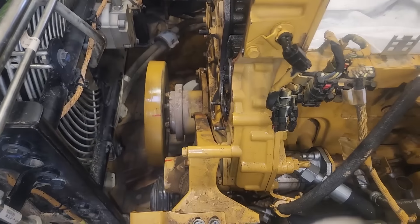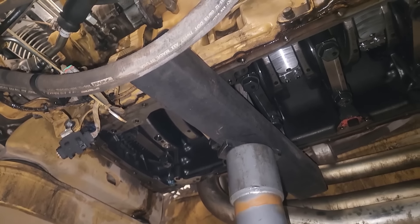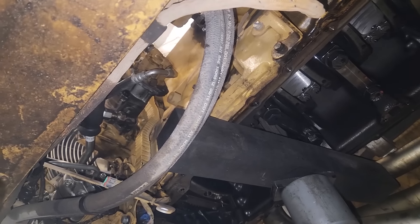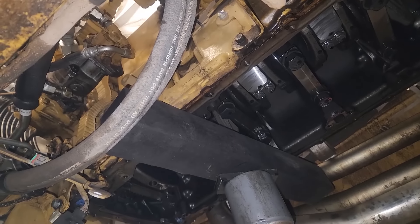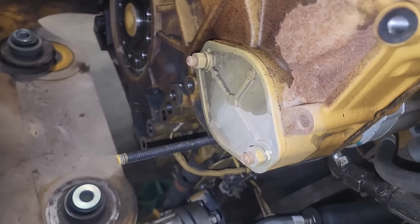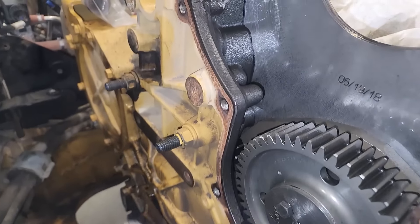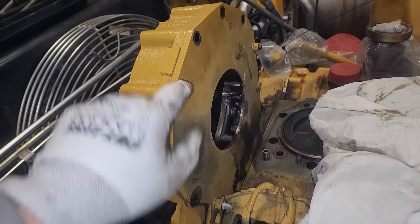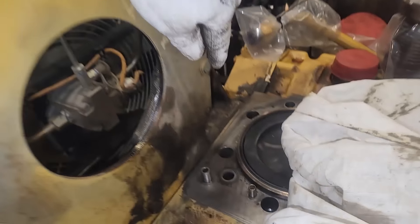Those are off - going to use the crane and get it out of there. So I pulled the oil pan, obviously. And what we're using here is this composite 4x4 and these pretty cool air jacks - you can run a pin through them and they're both a jack and a jack stand. So we've got the front motor mounts off. That's why you needed that block with the jack to hold the engine up - because obviously your front motor mounts are going through the front structure. So we've got a bunch of bolts.